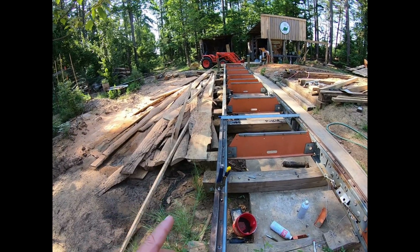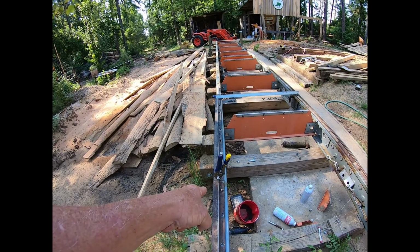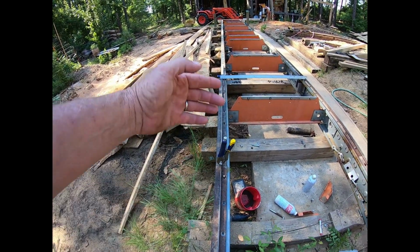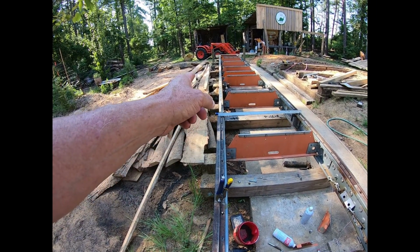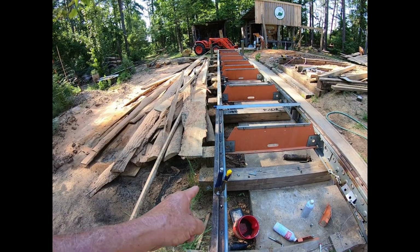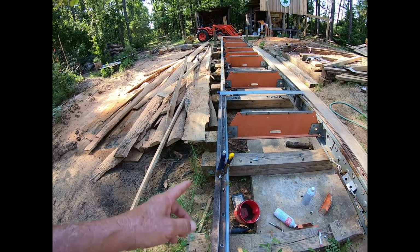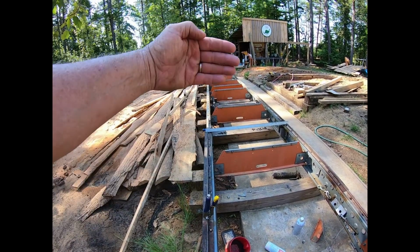And then I'll just continue down. I'll take the next one, put it there, and clamp it, just like here. There's no nut there right now. Just clamp it right here. I'll tap it a little bit to get it back snug, and put the bolt in and tighten it. Come here, put the bolt in, and before I loosen these, tighten it, and then check it with the tool. And I'll just keep doing that same progression all the way down.